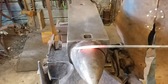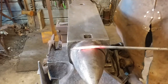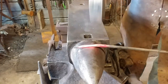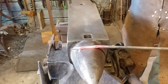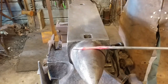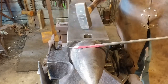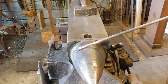The first step is you want to make a leaf blank. Once you get your leaf blank made, we'll turn that into a leaf. You can see I'm making the stem pretty narrow. Now that's working it too cold — I don't want to work it any colder than that. I'll get another heat and I'll be right back with you.